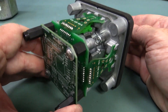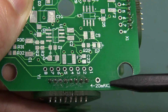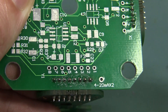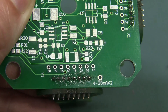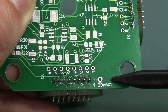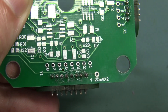And the PCB gives it away: '4 to 20 milliamp times 2.' That's a current loop output, so you'd get a proportional current output based on the movement of the joystick. The reason they use a current output instead of a voltage output is because industrial applications typically have big long wiring harnesses, and you don't want any interference. So a nice 4 to 20 milliamp industry standard current loop output and proportional output is exactly what you want.